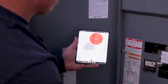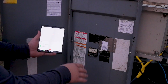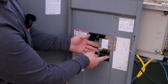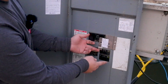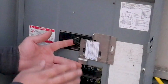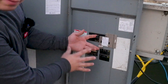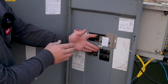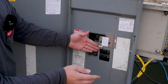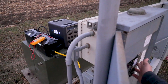I'm guessing almost immediately then this is going to — oh yeah, grayed out. So our power's off right now. The Sense energy monitor is not going to work because we're going to leave the 240-volt breaker that it's attached to turned off. So right now we are off from the utility and if we slide up our interlock kit here, that's going to prevent us from turning on this breaker, which is extremely important because that prevents us from backfeeding electricity onto the utility. You should never use the suicide cord that I briefly mentioned earlier because you could potentially leave the main breaker on and backfeed to the utility, potentially injuring or killing a lineman. Three, two, one.